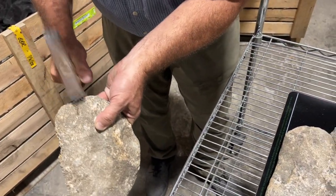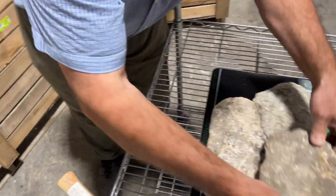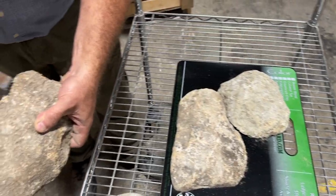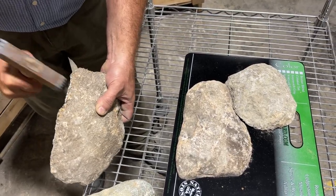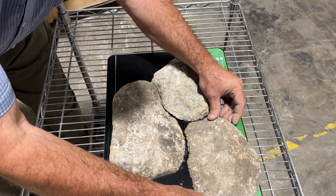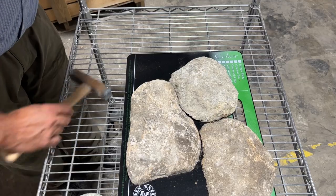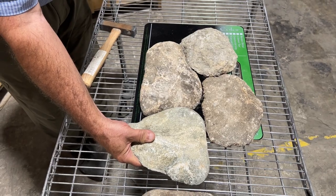The stones are really thin on the edge, so this trimming process is really quick. I could take off a little bit more here and drag this down — it'll be slightly better, and that's why you have to fit it in. It's not easy to see all these angles. That fits fairly nice and even, and later I'm going to put other stones in and around here. See how that would fit right in there pretty nicely without much trimming.